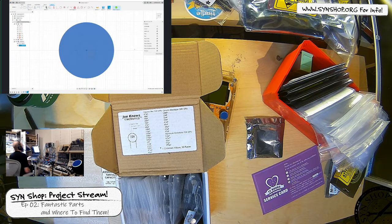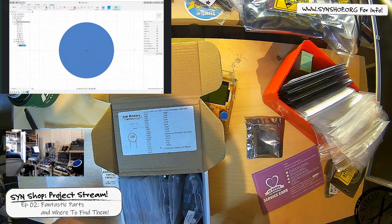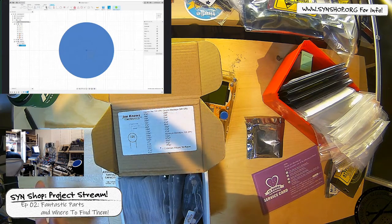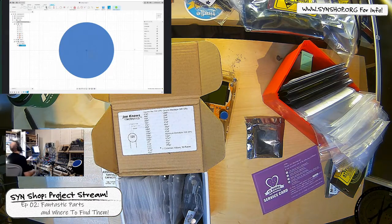If you came to learn how to do this stuff, you've come to the wrong place. I was wrong. Okay, so 1, 2, 3 places. So 0.33 would, yeah, like you were saying, be 330. Okay, so 330 nanofarads. You go to your handy dandy conversion chart, and that does the math of multiplying or dividing by 1,000 for you. Oh right, yeah. Yeah, I need to load one of those.